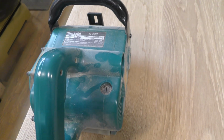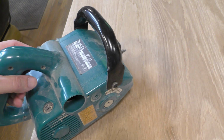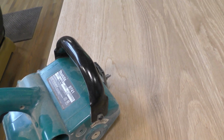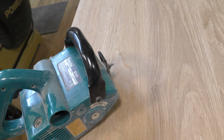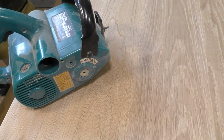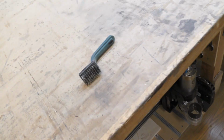So I'll wire brush like this, straight along the grain, and then I'll come back at a 45-degree angle, and that really gouges the wood, so to speak, to really pull out the deep cuts in the grain. And that can only really be done by a machine like this. So if you're into something like that, I would highly recommend that you use that type of machine.